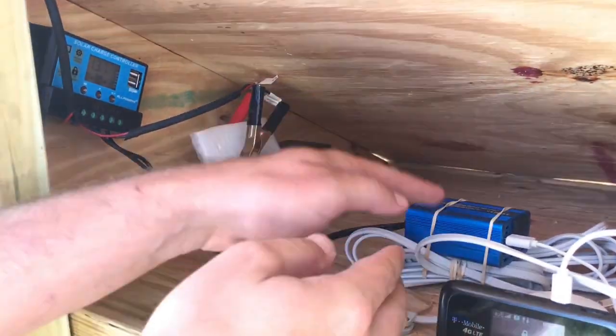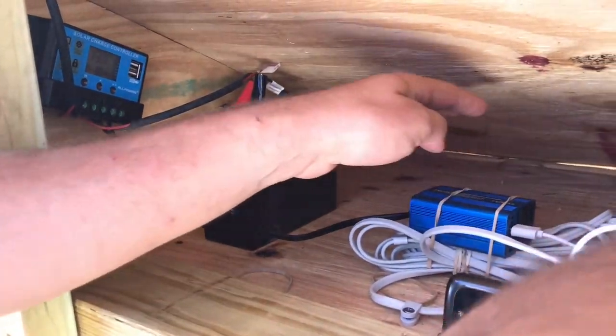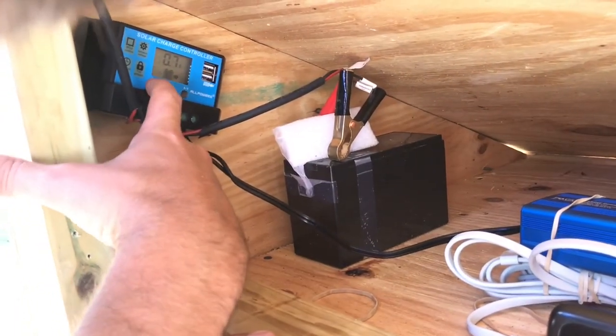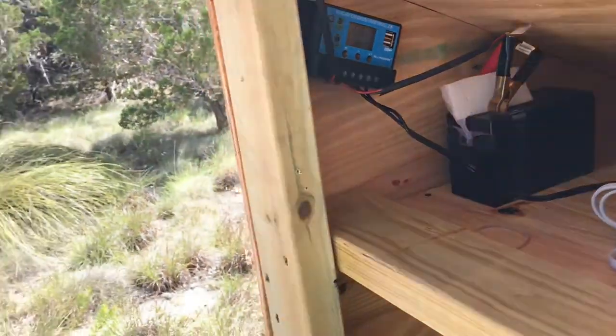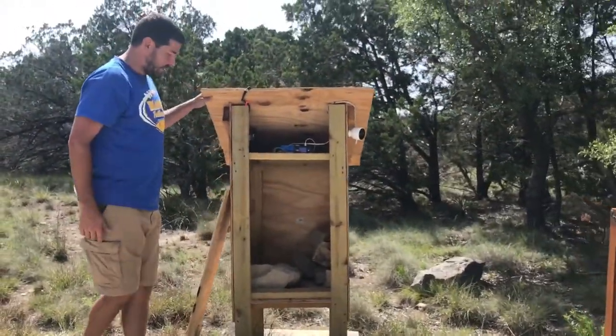Part of the draw is also whether or not this converter takes power — there's a fan that comes on and off whenever it gets hot, which is why I've got it mounted up with ventilation. So all together: this converter/inverter plus the Nest cam plus the hotspot — the inverter itself takes power, and the total comes to about 0.6 amps for the whole system.